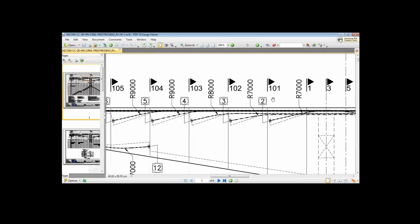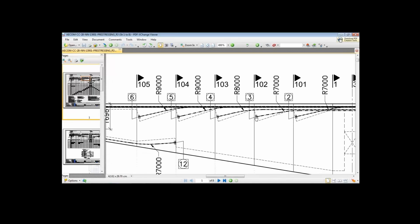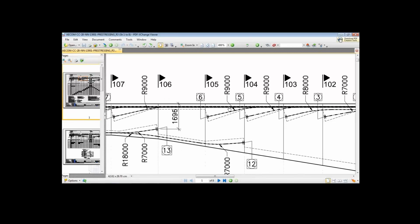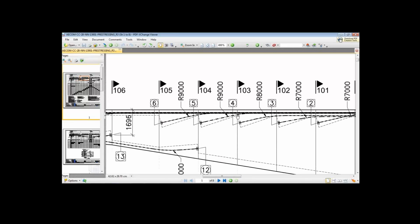So we need to have high compressive force in this part, and actually this problem will be there for each of the tendons at each of these segments. So we need to have high compressive stress at all these nodes, at all these fibers, so that there is no splitting of tendons when, let's say, cable number 4 is stressed. There is no splitting of tendon when cable number 5 is stressed.